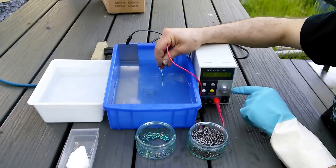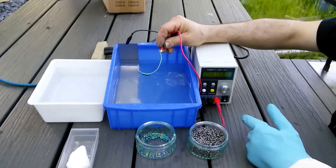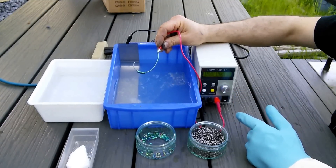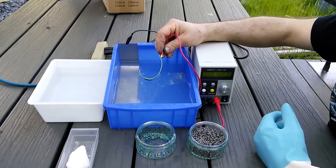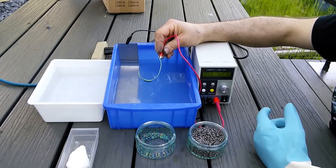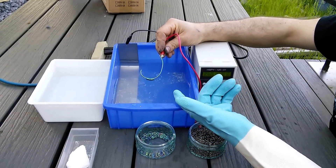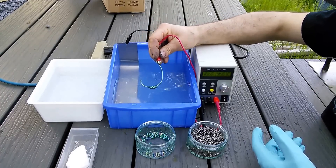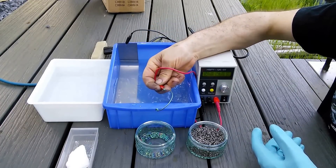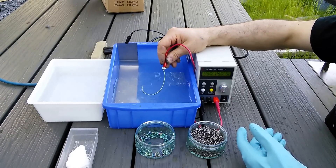The real beauty of having your own anodizer is the spectrum of colors — limited in that, for example, you can't get red — but when it's going from teal to green, you can get any shade imaginable between teal and green. We just sell one green that we call green, but if you're anodizing your own rings, you can make a hundred various shades of green.